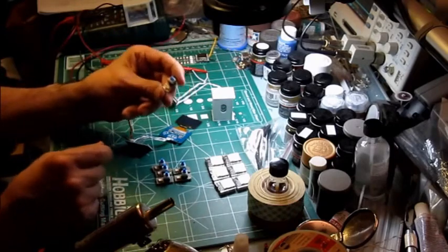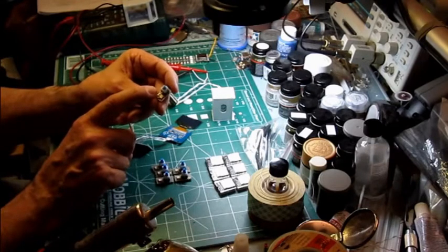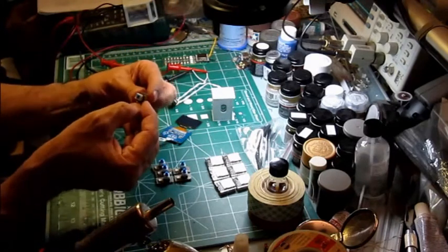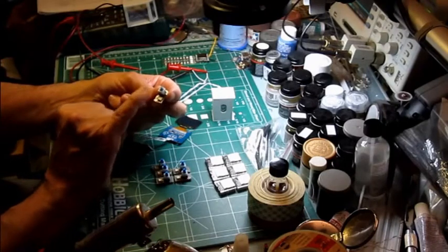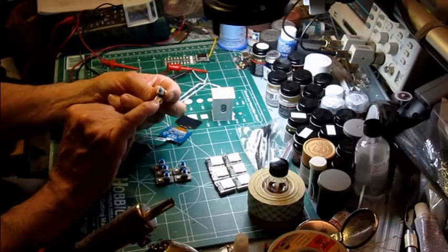This here is my power switch. I like the little button, but I didn't like its propensity to fail if handling a lot of current. So what I did to eliminate that is I have a solid state relay on there. All the switch does is handle the 20 milliamps necessary for the LED that's inside the solid state relay.